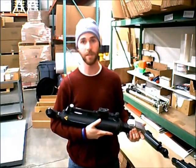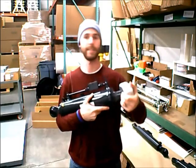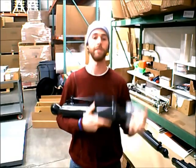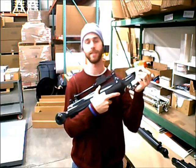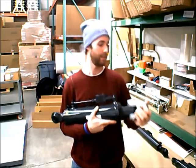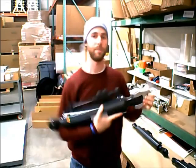The next one is the swivel, also called the clevis. The swivel is going to pivot back and forth — it attaches to the tractor end and it's for increased range of motion. Or if you want to leave the swivel on the tractor and move your top link to a different implement, you can leave the swivel in place. It works both side to side and, when mounted on the tractor, it'll go up and down.